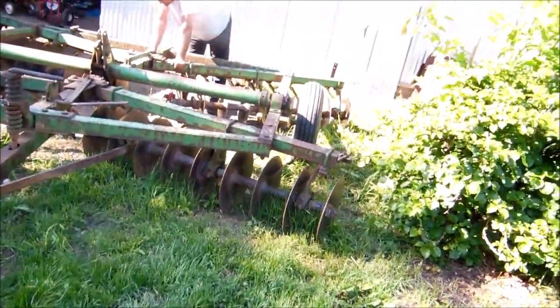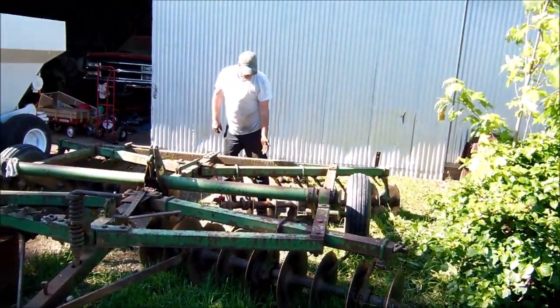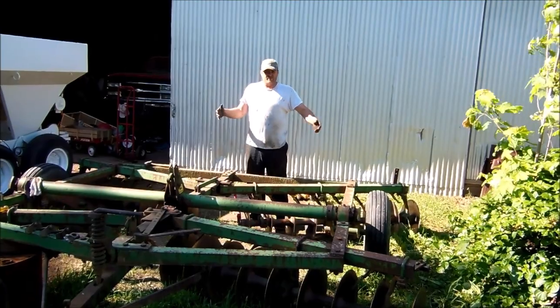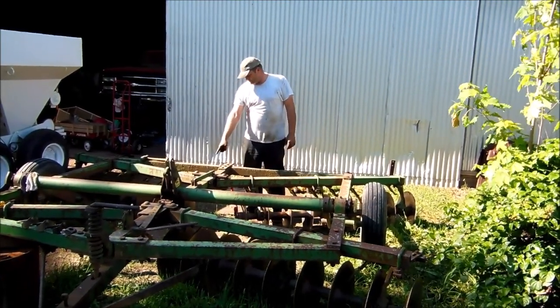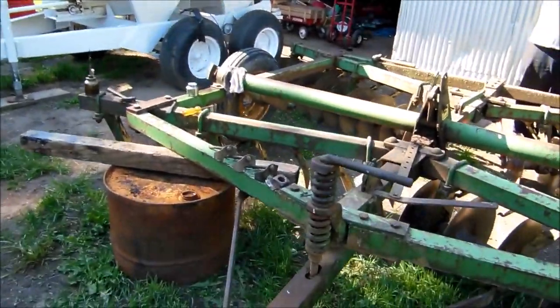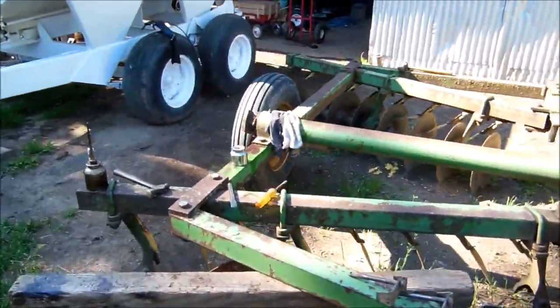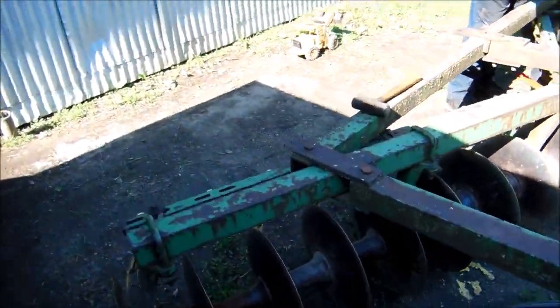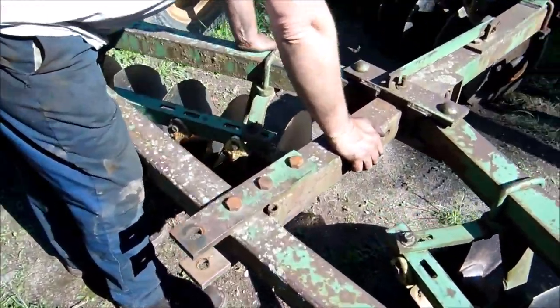Now, why would there be wear to cause a gap? They get loose, and they wear the parts out in the middle, so it gets narrower. So you buy these big washers, and you can make up for it. I see. So when they had an extra part off another, that part doesn't even go on this style disc. They had that laying around, so they took the end cap. For that gang, doubled it up on this one. They used washers other places, but it's just from wear.